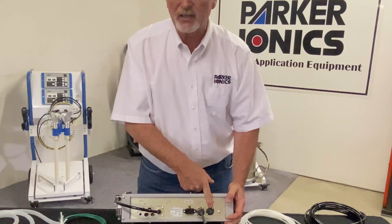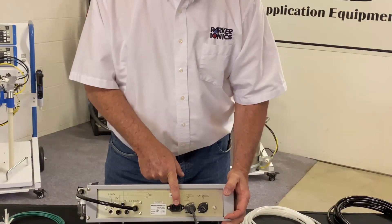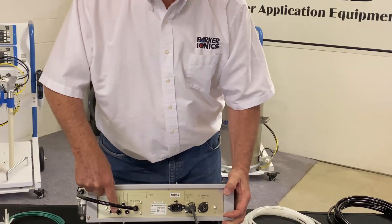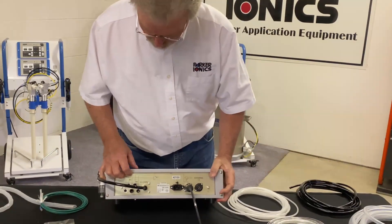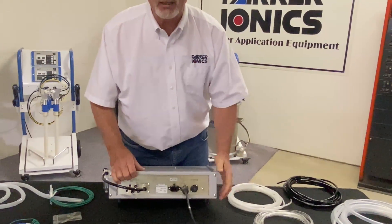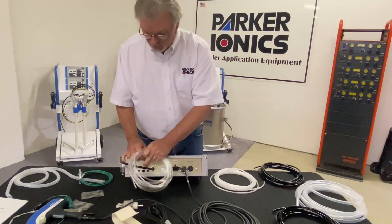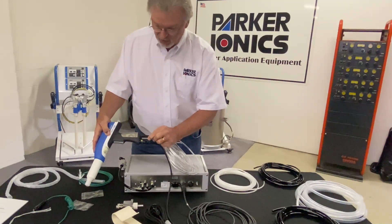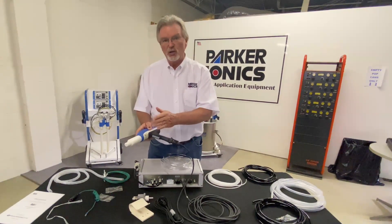This is an extra connector that is not applicable to the Simplicity system. This is where you put in your power cable that plugs into the wall. Over here you see these three air fittings — they're labeled. The generator air fitting is your FM or main air — that's this black hose. Your FS is your sub air — that's the white hose, and it goes to the back side of the injector. Your PT is your cleansing air — that's this clear hose. It runs from the back of the controller to the gun and connects up to the gun right here, providing cleansing air. We'll go through what that provides you later in the video.